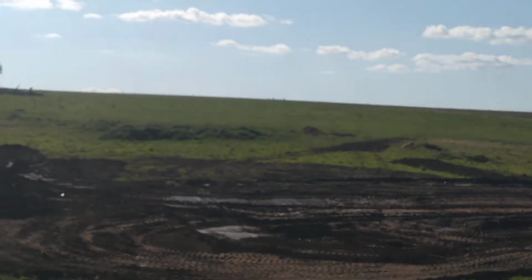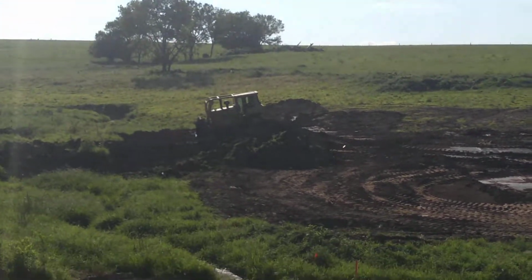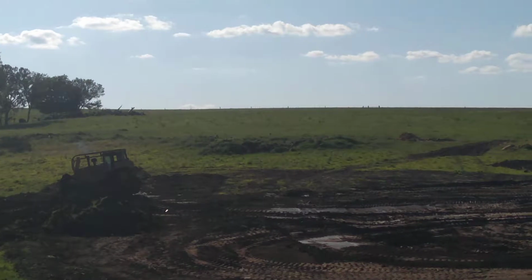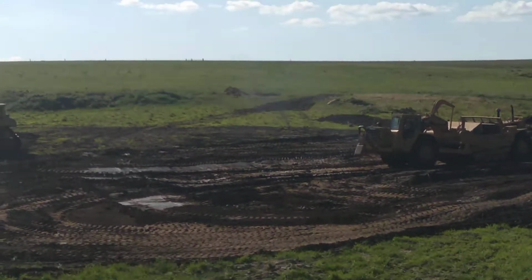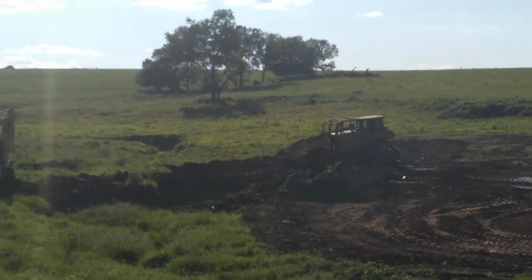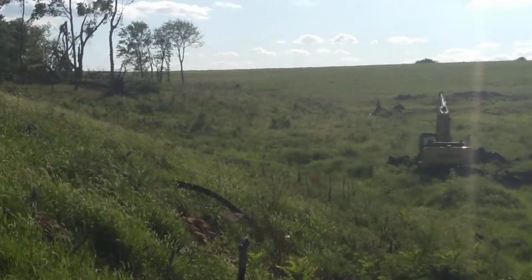And we gotta core, take all the dirt out of the middle for the dam, and then I think because we got rock issues on either side here. You can kind of see there's a rock pile right up there. It's not very thick, about 2 or 3 foot of fractured rock, but I think they're gonna have to go up on the hill somewhere to get more dirt because they don't have enough dirt here to build the whole entire dam the way they need to do it.